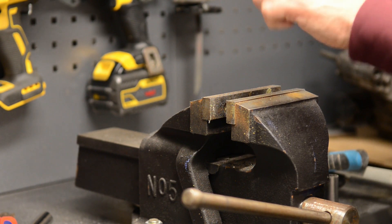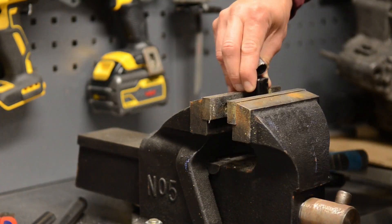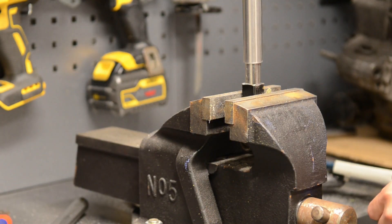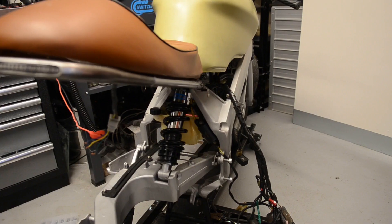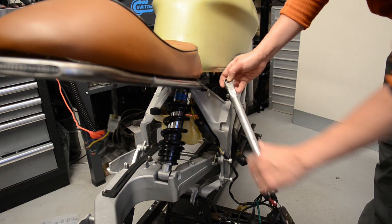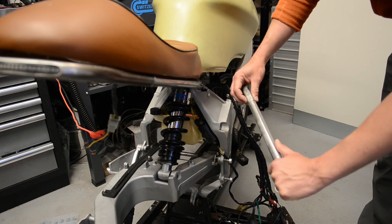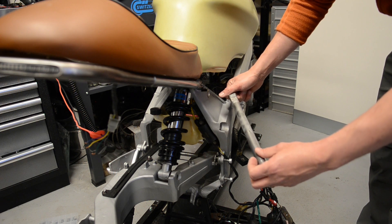First leg - that's solid even without welding. I welded this up - this is my weld, this is Mr. Honda's weld, and this is solid. What I did was one or two test welds and then I took a sledgehammer to it to make sure the weld doesn't let go. I was able to smash both parts and the weld never let go, so I'm happy with that.